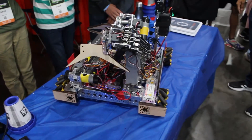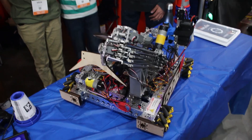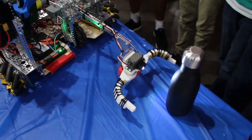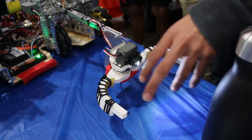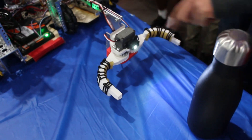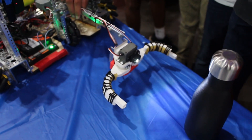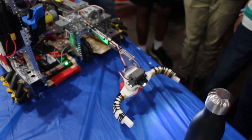Let's move on to your intake. You guys have a very compact and quick intake, so how did the design come about — what did you recognize that you needed to address that led to this design, and how has it changed throughout the season? We first started off trying to implement our own claw design, but that didn't work at all, so then we resorted to loony claws. We made a few revisions after the original loony claw — we wanted a wraparound, so we added extrusions that go out a bit further at a harsher angle, so that in autonomous we directly pick up from one axis. Adding these iterations to the claw just helps us pick up the top and bottom cone easier.